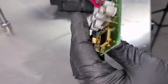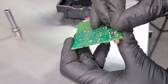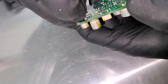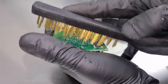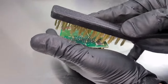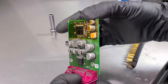The deionized water did a very good job cleaning the entire circuit board. For a few trouble spots, a single copper bristle is used to poke around behind each component leg and agitate the corrosion - we don't want any of it shorting leads to each other. If you're very gentle you can use a brass brush - not steel - along the leads to remove a little more corrosion. Don't scrape up the whole board; just hit trouble areas. Done cleaning - really happy with the results considering what it looked like before. That's how you clean a circuit board with water.